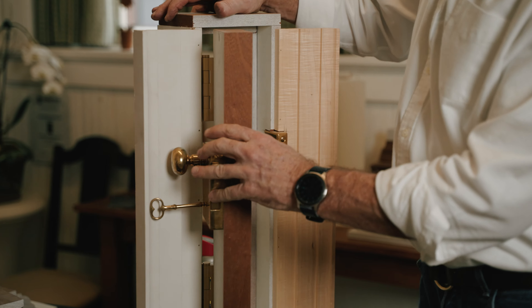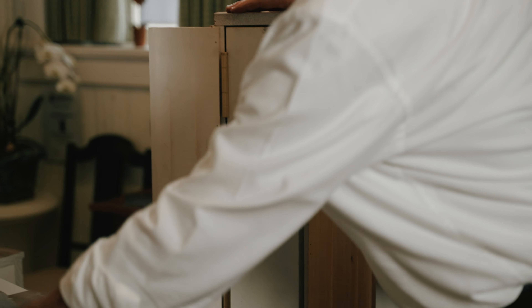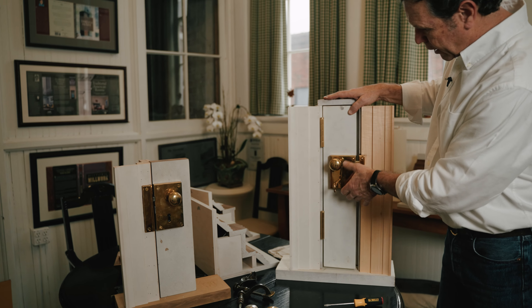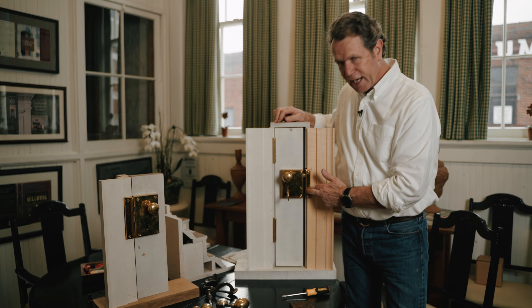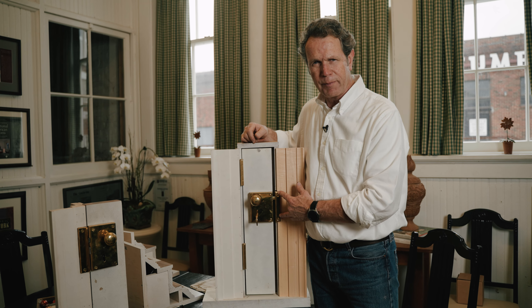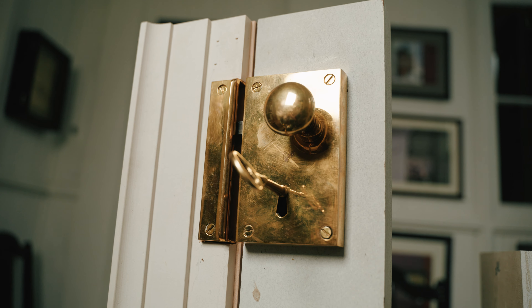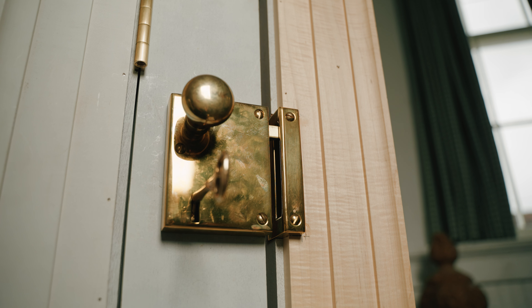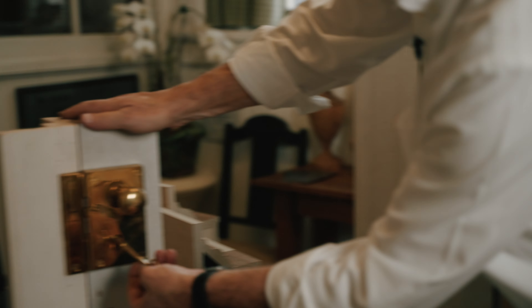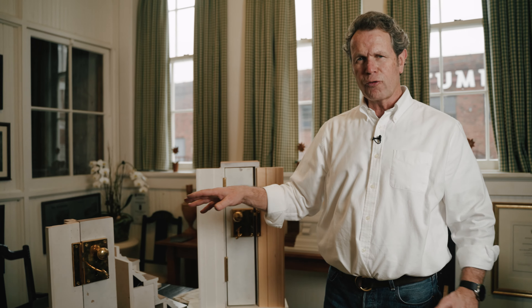We made this up for a client. You can see that the door opens - this is what your hardware is on the other side. These rim locks can be rectangular, they can be vertical rectangulars like this one. Your catch, because you have a catch that fits inside the door, is kind of mortised and notched into the trim. Here's a little bit more decorative catch on this door, and it too is cut into the trim. You will need to cut it into the trim - it doesn't go into the jamb. Oftentimes the throw on these locks isn't very far. Sometimes people will want to put a secondary lock on because that's only going to throw about this far, and sometimes deadbolts will throw an inch and a half. So for security you may not want that, but for decoration it's just fabulous.